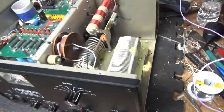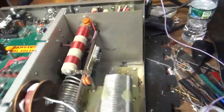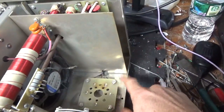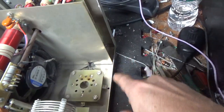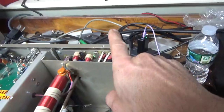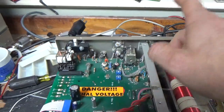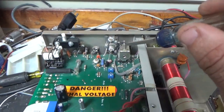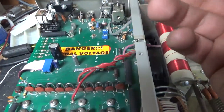So: plate tune air variable cap has damaged plates — I'll show it after I remove it. Socket had some heating, probably had a grid-to-filament short. I looked at the clips, they look okay. Ground the grids right to the metal, add the gas discharge tubes, remove the metal oxide varistors, replace the SO239s — they don't have great grip. Clean the TR/bias relay contacts with Deoxit Gold, and the soft start relay contacts with Deoxit Gold.